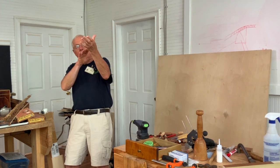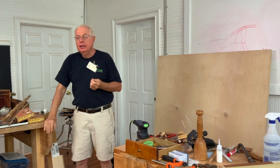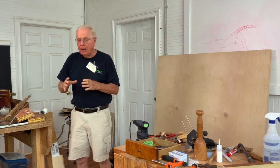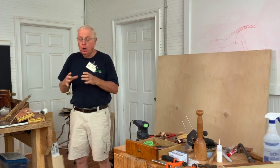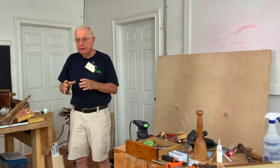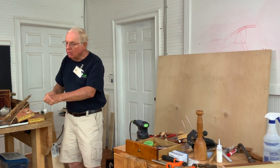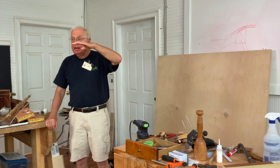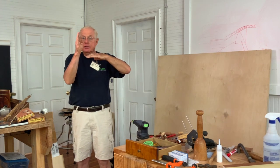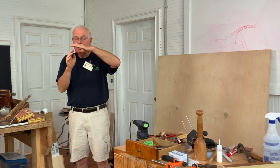So I can hold it up to a raking light and I can see these scratches all going in the same direction. Then I take my 6-inch Bosch, or 6-inch Festool sander with a 100 grit disc in it. I use a 100 grit belt, use a 100 grit disc. Go, like we were talking about, over the whole surface carefully. Hold it up to the light, now I can't see those straight lines anymore, they're gone. But there are little swirls in there. You can't hardly see them, but they're there.